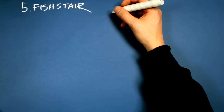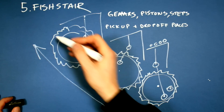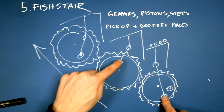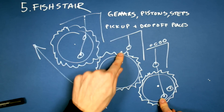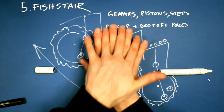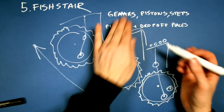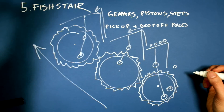Section 5: The fish stair. It's a very elegant way of lifting marbles up in a Marble Machine. By putting gears on an angle and adding pistons to every other gear at 180 degrees, one piston goes down while another goes up in an interchangeable system. While one step goes up, the marbles fall over to the next step, and then that step goes up and they fall over to the next — that's how the marbles climb the fish stair.